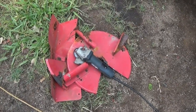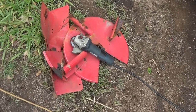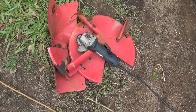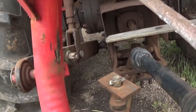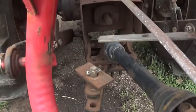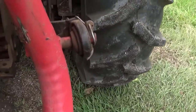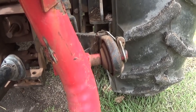Here's all the stuff that I've cut off. I used a five inch angle grinder - a 125mm disc angle grinder, 1mm thick disc - and cut all the parts off that I had to fix. This is what it looks like now. You can see up here there were brackets that held that angle piece, that guard on. They were just made out of really light material - only about one and a half millimetre steel. So I'll clean all that up and I'll replace it with something with a little bit more guts.